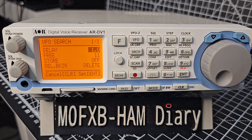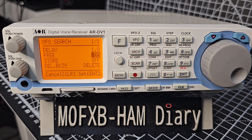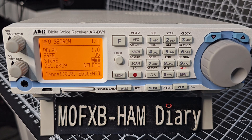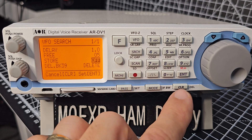So you've got the delay there. This decides how long you will remain on an active channel. The free section says: you've decided how long you want it to delay — this selection determines how long the receiver will remain on an active frequency before resuming searching, even if the signal is still busy. Moving down with the up and down arrows, the store option is very convenient — if that's turned on, it will literally save it to bank 39 by default. That's quite a cool setting.